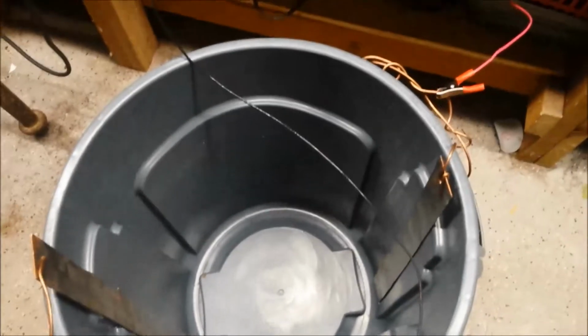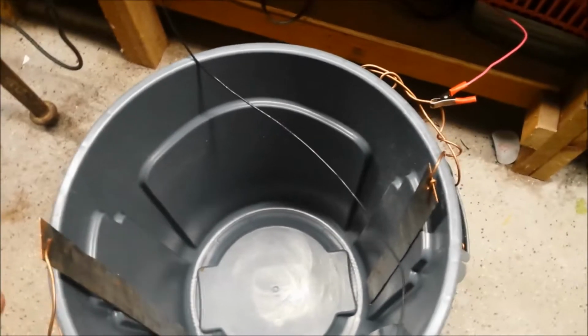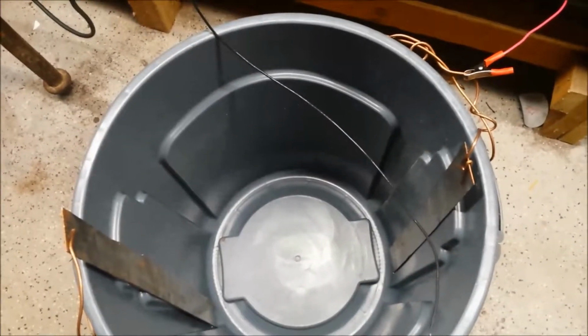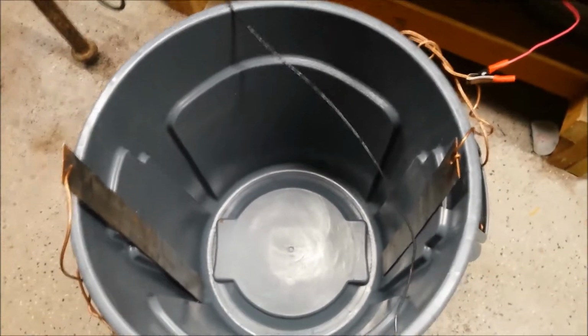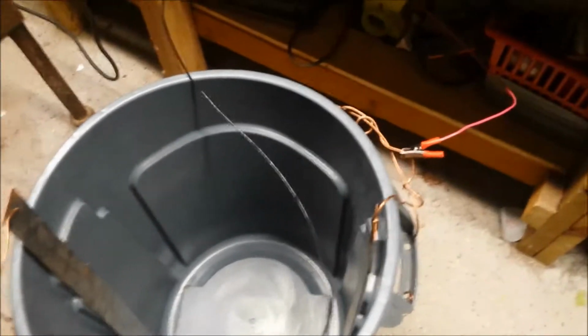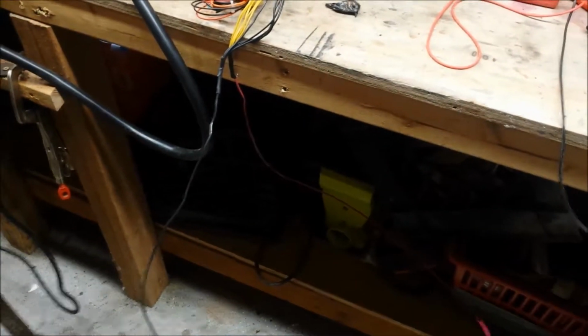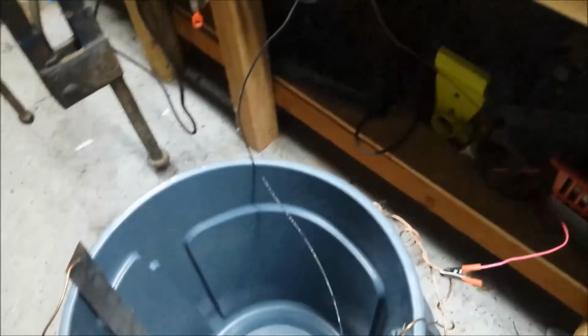Now typically and ideally the power supply for a contraption like this is a battery charger, but you need the right kind of battery charger. A manual battery charger is what you need. The battery chargers that they market today have all kinds of safety shutoffs and microprocessors and controls, and they just don't work unless you modify them or whatever. If you have an old battery charger that's just a manual battery charger, that's the way to go.